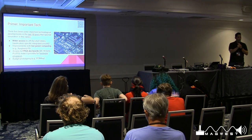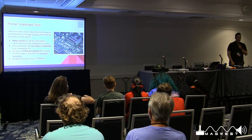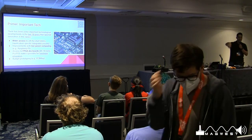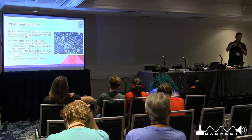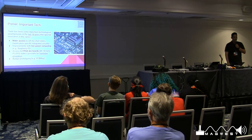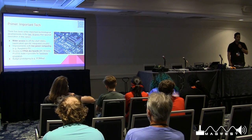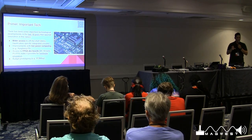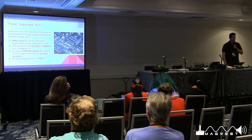Because of low-power computing advances, these new mods can piggyback on the console's existing 5V or 3V logic — you don't need to add an additional power source to get new mods to work. There's also access to FPGA dev boards — the DE10 Nano, which is popular in the MiSTer community, and the Pluto dev board, which has been leveraged to create an HDMI output system for the GameCube in particular. Budget prototyping through places like PCBWay has also been crucial.